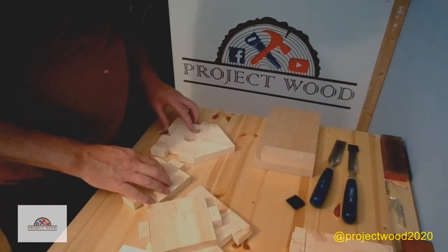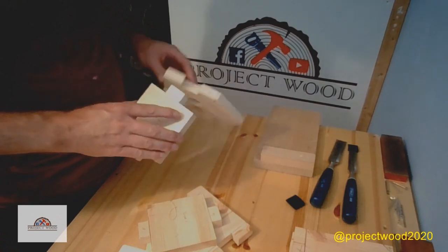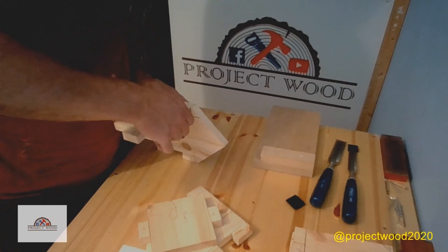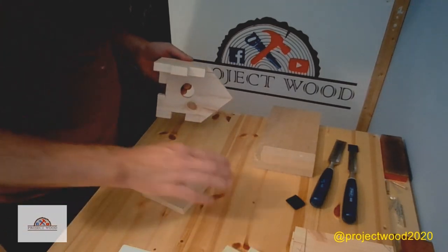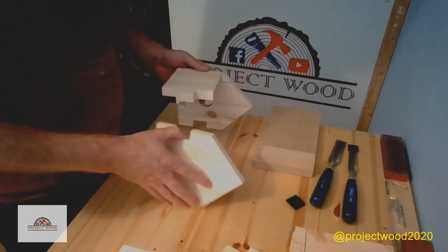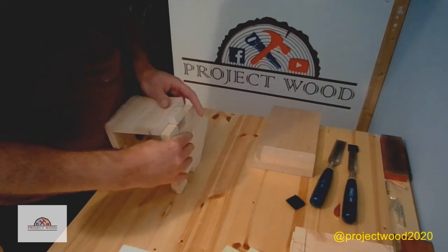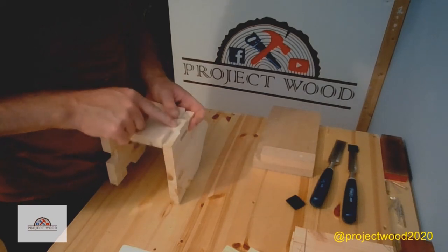Okay, so we've done a lot of chiseling there on the joints, just maybe 40 minutes, 10 minutes each. We then proceed to do what's called a dry fit, where you push it all together by hand. If it's a little bit loose now, it's not a major problem, as you will be putting some glue in as well. It's much more important that they go together without any force, as you could snap the pins off the male parts.